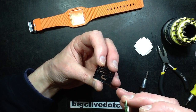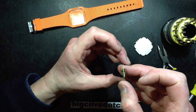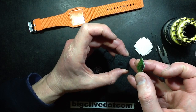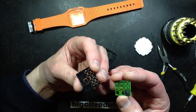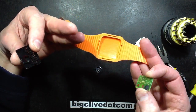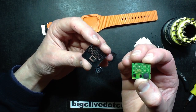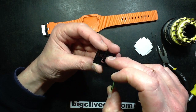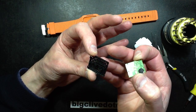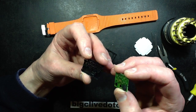The optical qualities aren't really improved, but the light guide or reflector for this is black. It kind of works - looking at the display it's kind of visible, and it just gets diffused. You get these in all different colours including black, blue, or green, which isn't going to pass an awful lot of light from the red LEDs. I was thinking they could have used white, though I don't know if that would have caused read-through between the segments, or if it would have been okay and just provided brighter digits.